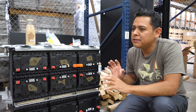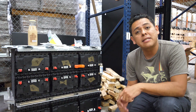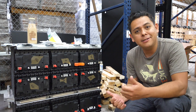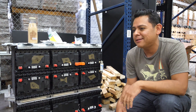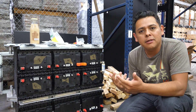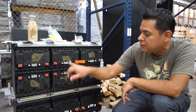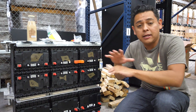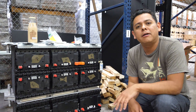Right now we're at the stage where I'm designing all the cabling and equipment. Once I nail down the design, I'll be calling all of you who signed up to come help me — this is going to happen pretty soon. I'm going to need you to show up and help me build all these packs. We'll screw them together and test the modules. There's going to be a process where I have to balance all the modules because there's a lot of energy involved. One might be at 60 volts, another at 56 volts — there's a voltage difference. We have to transfer energy between them so that when I connect them all in parallel to run this building, they're all fairly balanced.